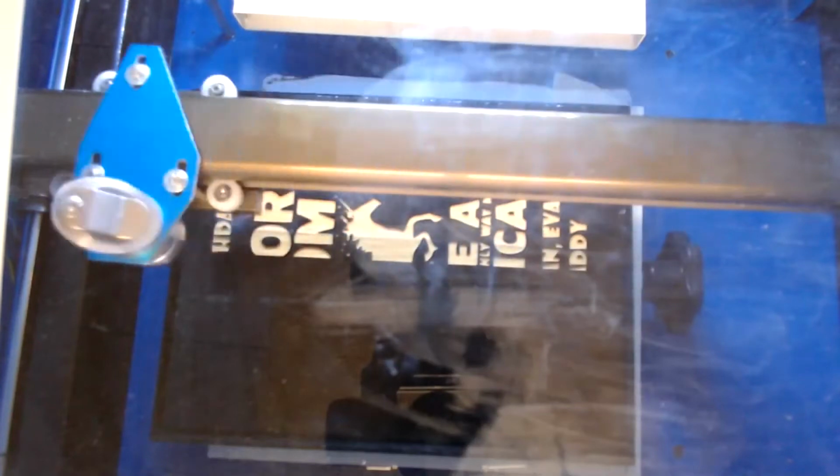On the short answer, if you did multiple passes on a single job, then in theory you could do that. Think of it like slicing with a 3D printer. If you know what your depth is going to be, you could start with the perimeter and cut out the material you want with single passes. Then with the next layer, you overlap, and you keep doing that, and you could end up doing an elevation map, but it would take forever.